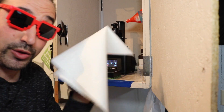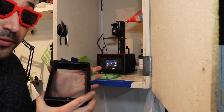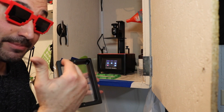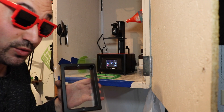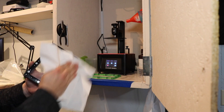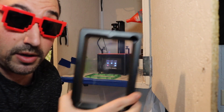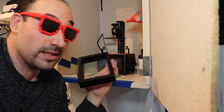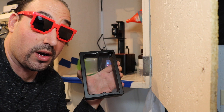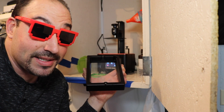The biggest thing with this printer is you're going to go through a lot of paper towels. I always clean the LCD screen before a print even if it's super clean. I use regular Windex glass cleaner — spray it, wipe it down, spray the other side, wipe that down. Over time the FEP film gets pretty worn looking with marks, but it's still printing good after about 48 prints. I haven't had to replace it yet. They're around $5 a piece, and I think you can probably get 50 to 60 prints out of one before you have to replace it.